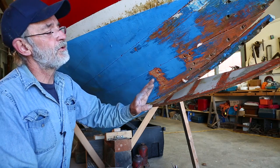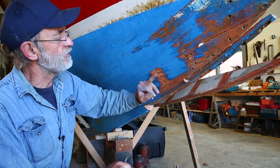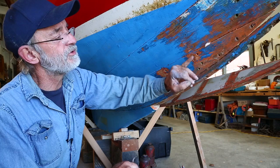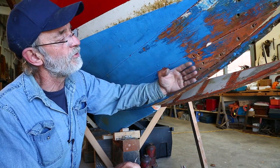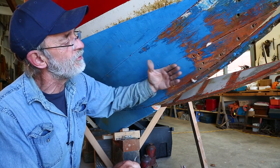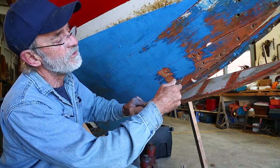Now that we've got all the screws out of the hood end of this garboard plank here, we're going to actually remove some of the seam compound that's on top of the cotton, and then show you a little trick method of getting the cotton out of there as well before we actually spring the plank out. There'll be quite a bit of resistance to that springing with this cotton caulking in the way. So we're going to take this little reefing hook now.